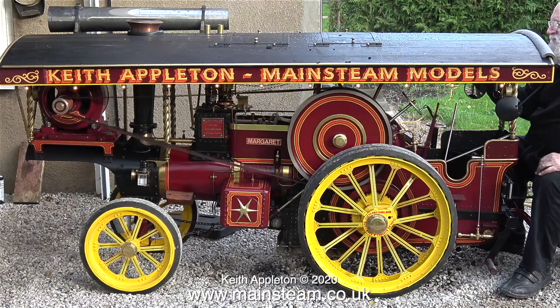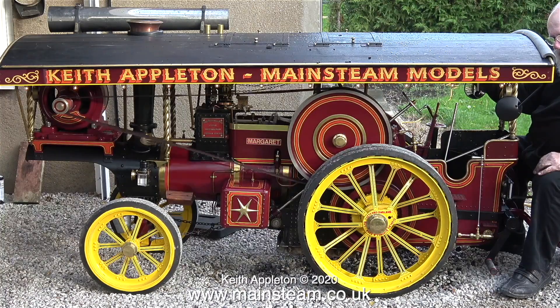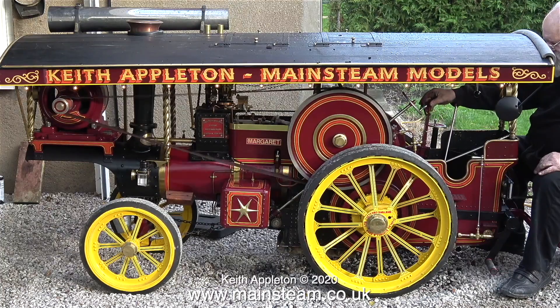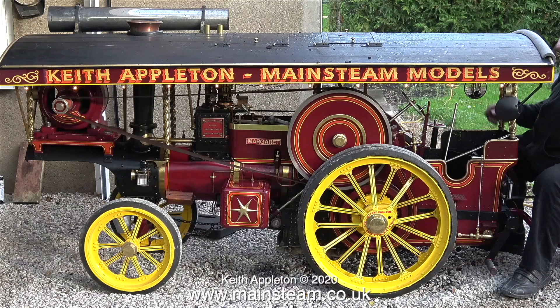You may be thinking: why didn't I buy a steel boiler traction engine? One problem with steel boilers is that after a few years you will generally need to replace the tubes. If you buy a traction engine with a brand new steel boiler and look after it - blowing it down after every run and using water treatment that coats the inside with tannin to slow rusting - there's no reason a steel boiler couldn't last quite a long time. But I didn't want to take the chance, because this was a used model built in 1995, and when I saw something of this size with a copper boiler, I thought yes, this is the one for me.